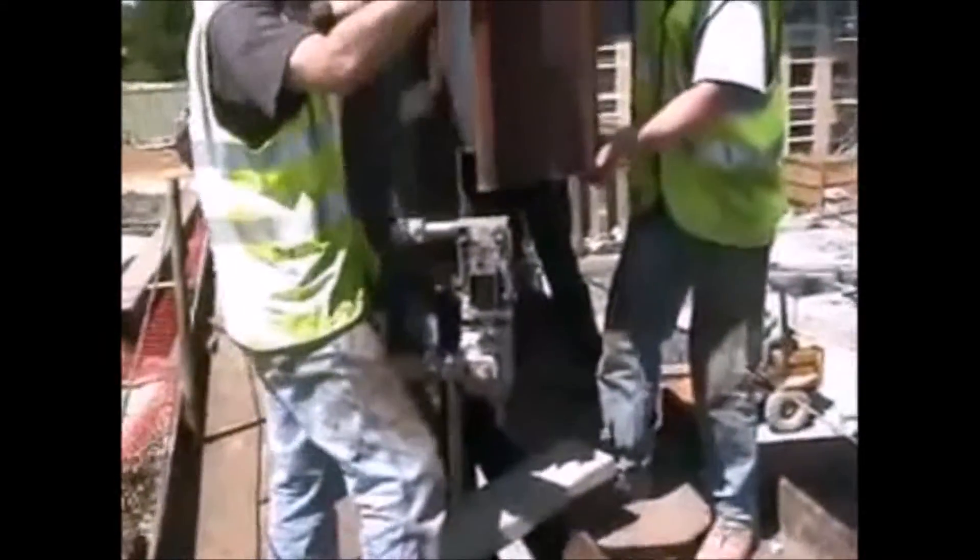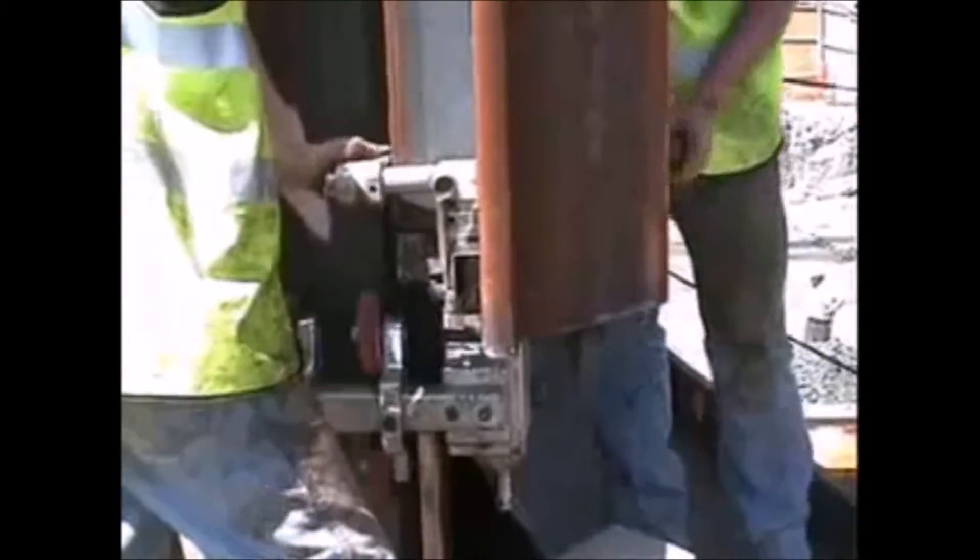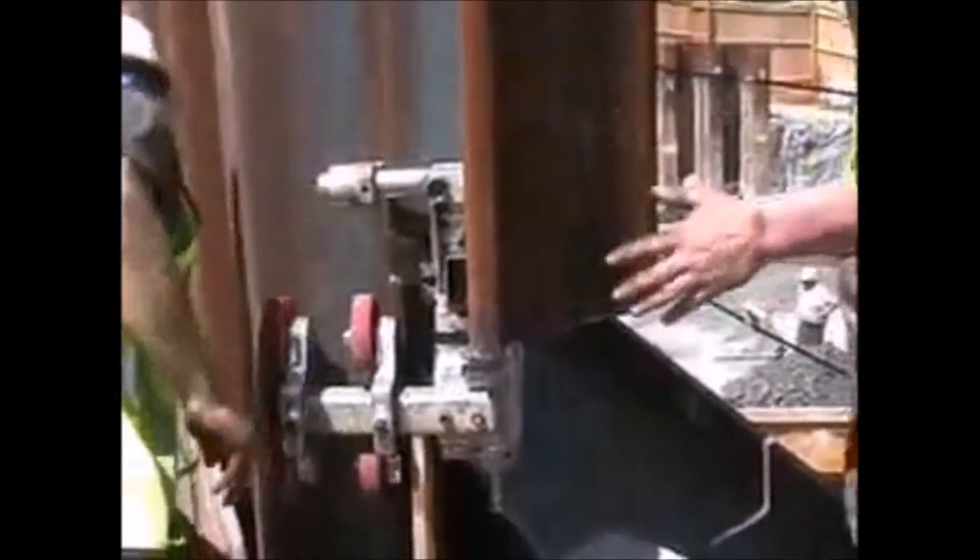The pile to be pitched is gently lowered into the vise block and pushed into light contact with the vise stop. The vise screw is then fully tightened. It is good practice to swing the vise stop out of the way to prevent damage.